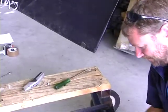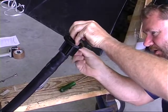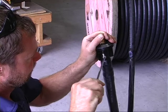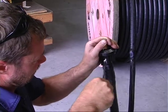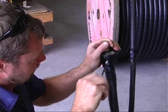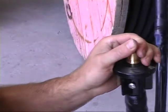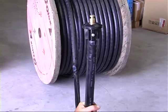Replace the mass butt adapter section and ensure that the bolt is tight and secure. The lugged HVSC is now ready for connection to the base of the terminal. Screw the terminal onto the completed base assembly and secure with the supplied M6 locking grub screw.